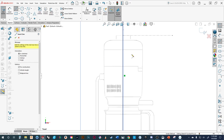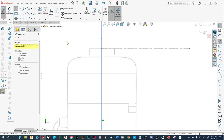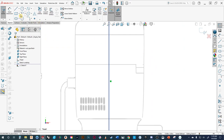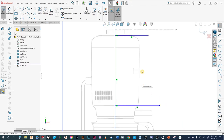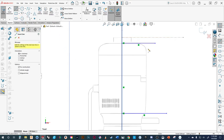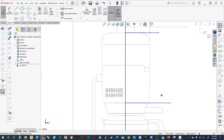We can see this is one main piece with the radius that drops down. So we'll build out this first portion. I'll draw my top line and go straight out. Right now I'm not going to fully define this — I'll show you why in a second. I now have this, and I'm going to use a spline. Let me create a quick guideline of where I think the spline is going to go. I'll grab my spline tool. One of the biggest mistakes people make is trying to copy the form exactly using a whole bunch of points.